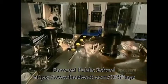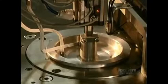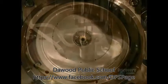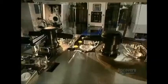It consists of covering the plastic disc with a very thin coating of aluminum. Here we see the inside of the mold, where the aluminum coating is applied. In this facility, almost everything is automated. This allows for the production of over 100,000 compact discs per day.